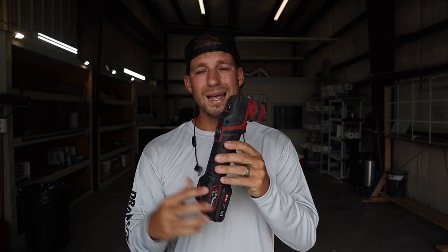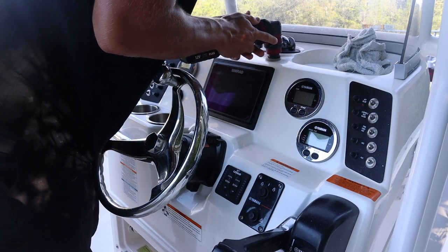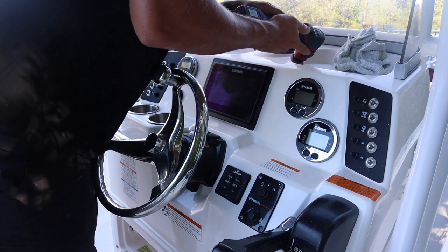You can mod these — you can take a drill and drill that out and put it on the rotary. The only reason I did not do that is because I have a feeling it's going to wear out the motor very quickly. If you put the rotary adapter on the three-inch, it's going to cause too much torque and the motor will burn out. I don't know that for sure, but I think you're going to shorten the life of this machine drastically.